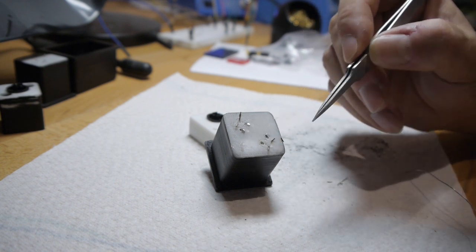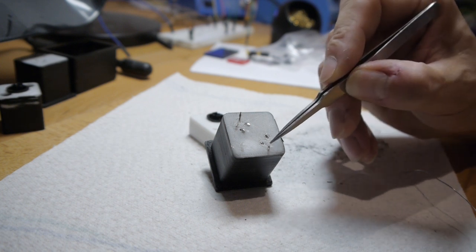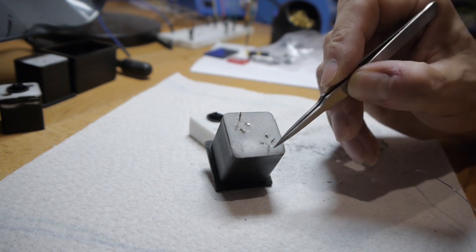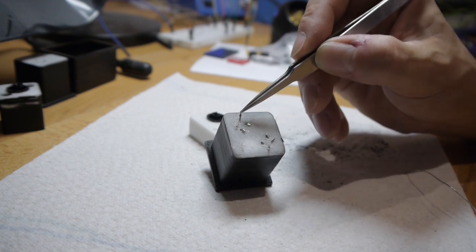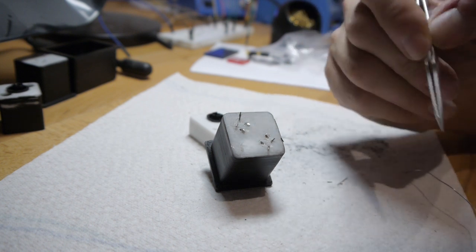And the colored wire for the LEDs will be soldered to one of the longer legs of the LED, which is the anode, and then I will route the cable from the short pin to the other long leg of the other LED and a ground cable back to the Arduino.